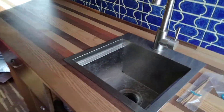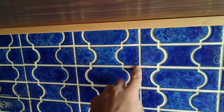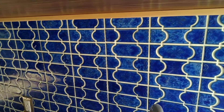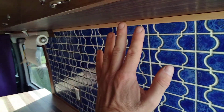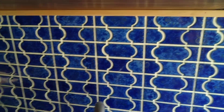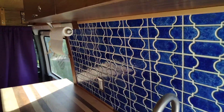You can see my counter — these are actually pool tiles I got for free. I did a lot of research and found a company in Florida that makes silicone grout and adhesive — it's great, designed for pools too. The van walls aren't straight, so it's hard to stick something adhesive without it moving, but this adhesive — you hold it for a minute and it stays right where you squeezed it on. For the grout you need their special applicator and have to move fast, but I could shake this panel and that tile's not going anywhere.